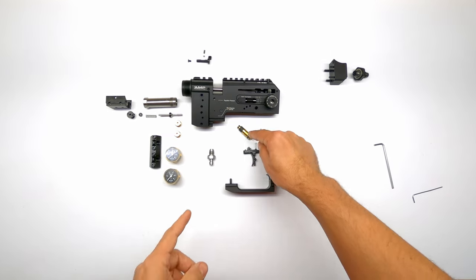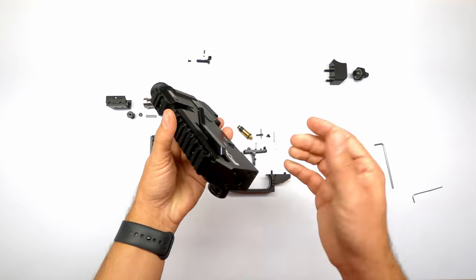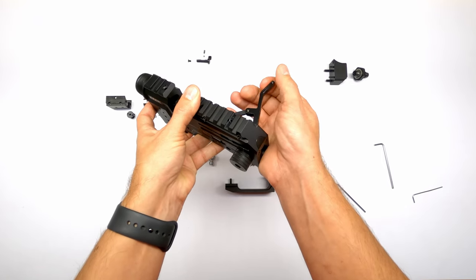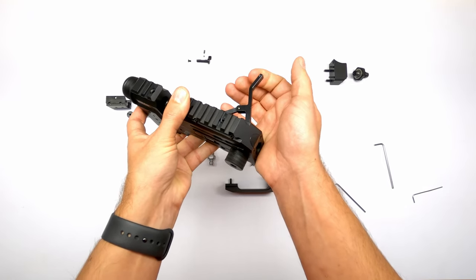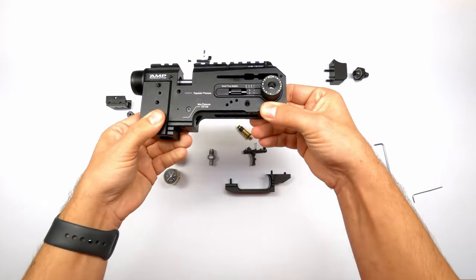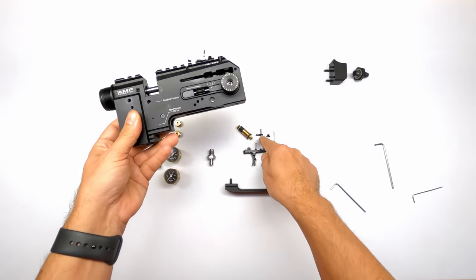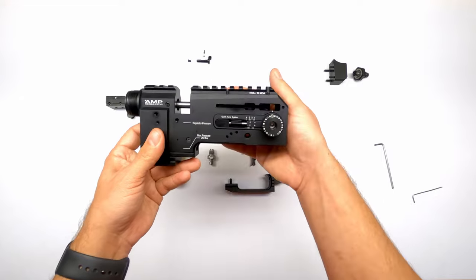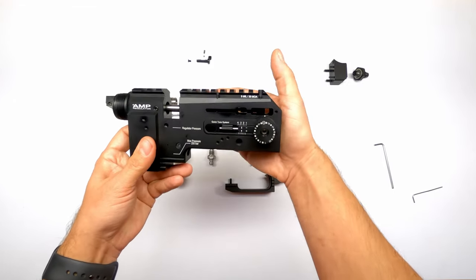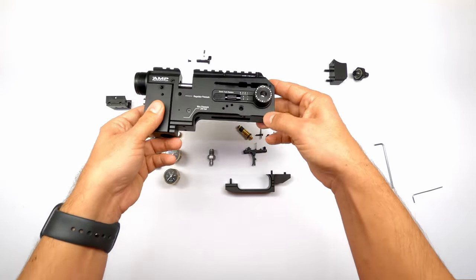Next we'll address the regulator and put it inside. You'd probably have the tendency now to see if everything cocks and works — I can feel there is a lot of pressure from the spring already inside, so I think everything is okay. But before the trigger is even inside I wouldn't advise to cock it, as there is also no sear yet to hold it back. Once the trigger is in we can completely check if it all works like it should.